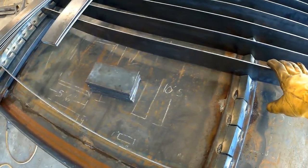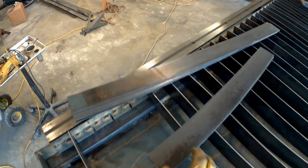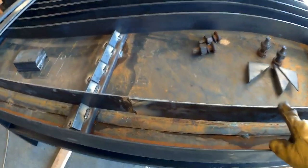When I left off, I was short on slats — needed 41, I think I had 36, so five more to do. I took some leftover long pieces, cut one side down, put the long side in, lined up the short side, and welded them together. That made the rest of the slats I need without a store trip. Unlike wood, if you mess something up with metal you can just weld more metal onto it. Kind of a hack, but it'll get this thing done.